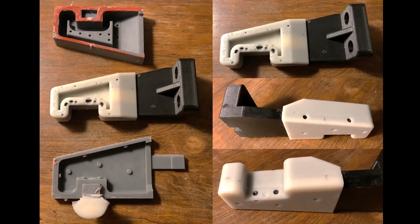As I mentioned earlier, if you have a vacuum chamber, you definitely need to degas the resin before you pour it. Otherwise, you end up with these bubbles here. Obviously you can tap on the mold as much as you want, but you're not going to be able to get all the bubbles out. So I had some bubbles on the top, despite all the vent holes I put in, but there were very, very few to none at all everywhere else. It was just on that top surface.